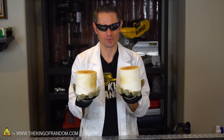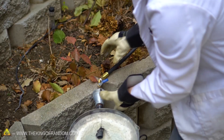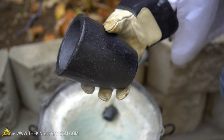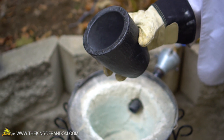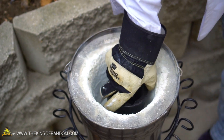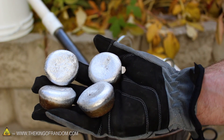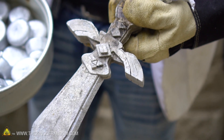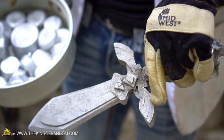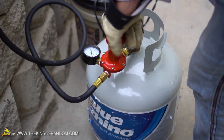It's actually starting to burn my hands, so let's go whip up a batch of molten aluminum, pour these molds, and see if they actually work. This is a brand new clay graphite crucible — technically you're supposed to let it run through a cycle of warming up and cooling down, or there's a chance it could split. But I'm not really that patient, so I'm just gonna throw it in and hope it survives. For aluminum scrap I've got some mini metal biscuits and this old aluminum master sword — it was a little bent and wonky, so we're gonna melt it down and use it to make some pokeballs.